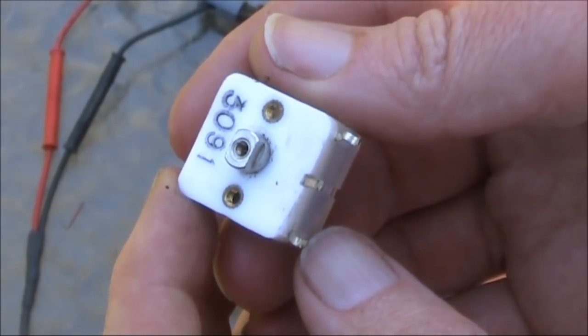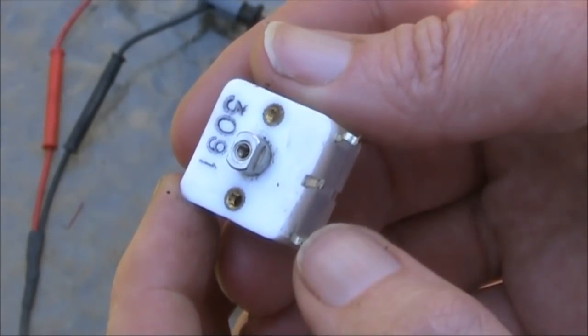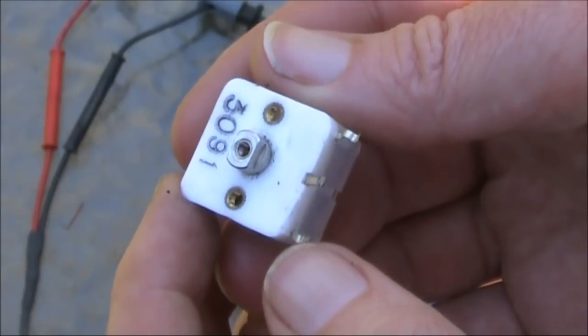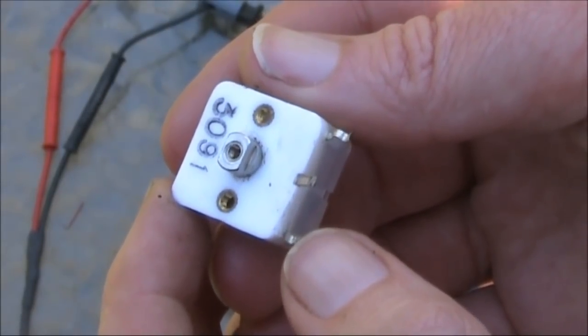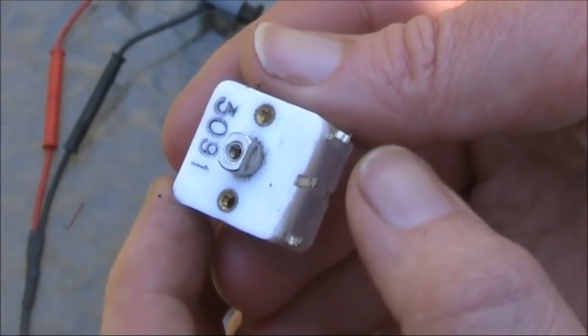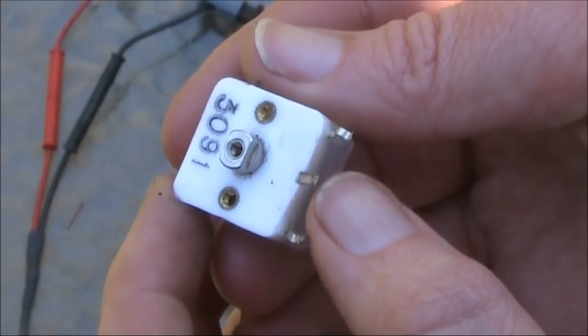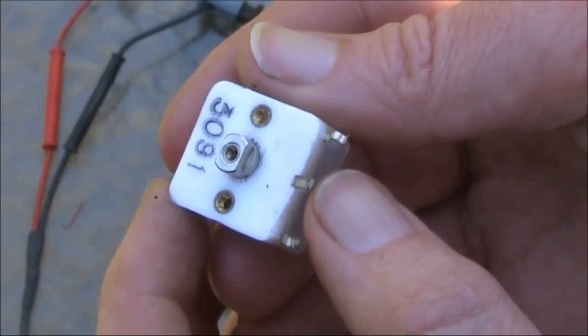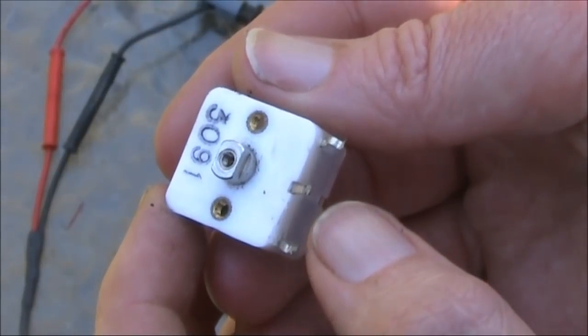In the case of an AM broadcast receiver, the local oscillator is normally above the received frequency range. In other words, your received frequency range might go from 530 kHz to 1600 kHz, then the local oscillator will be about 455 kHz above that — that's the IF. In other words, roughly 1–2 MHz.